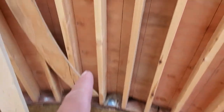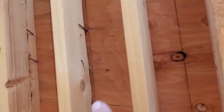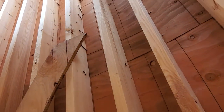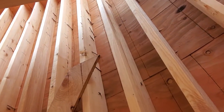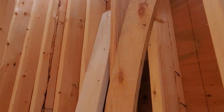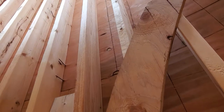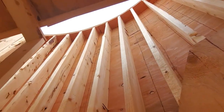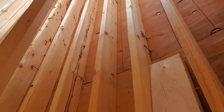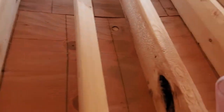You see we got it bolted down in here, and then you can see how our studs go. We got some misses here — right here, they're going to do something about that. Look at all the misses up through there; must have been apprentice day on the nailing. What we've done here is, as they go along, that top plate is the same thing as our bottom plate, and we just continually nail these studs right into it as we go.